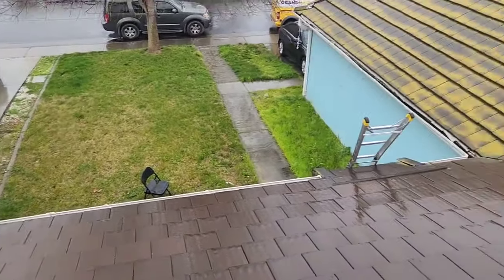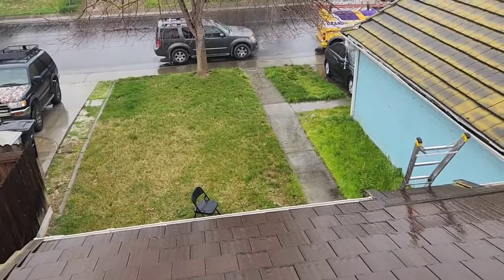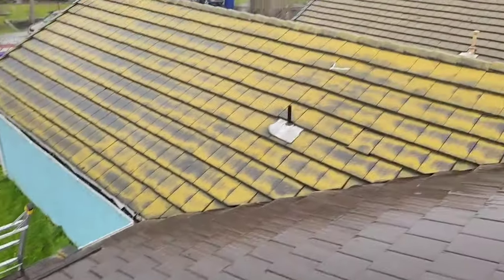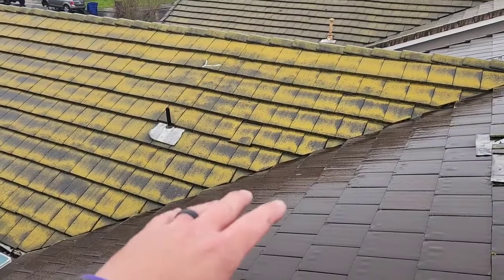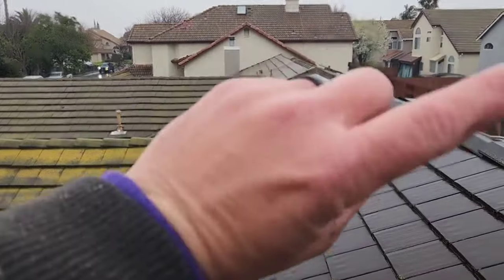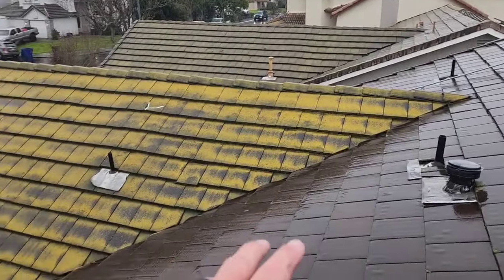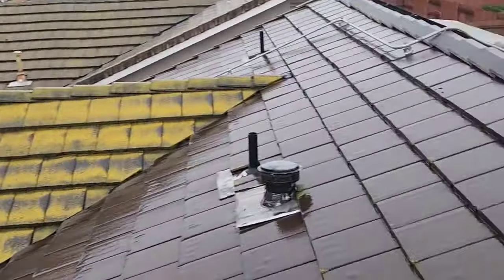I also notice the gutters are in really bad shape, so I'm not sure if you're interested in getting new gutters, but that would be something I'd recommend. These plastic gutters do okay, but we have six-inch seamless gutters that we install — let us know if you're interested. To summarize: broken tiles, roof maintenance, open up the valleys, clean them out, adjust the channel pan to make sure water flows with no blockages causing ponding, all ridge transitions need lead flashing, seal and secure all roof jacks to code — like this one here which is lifting pretty badly.